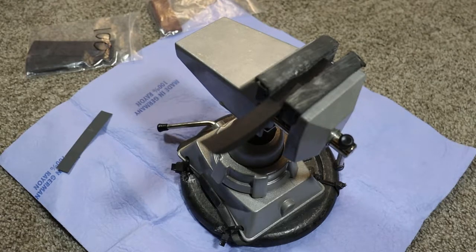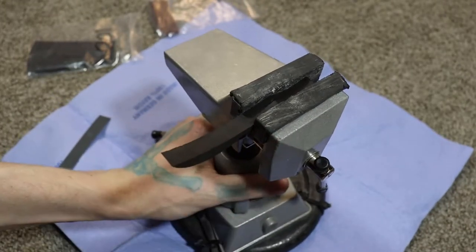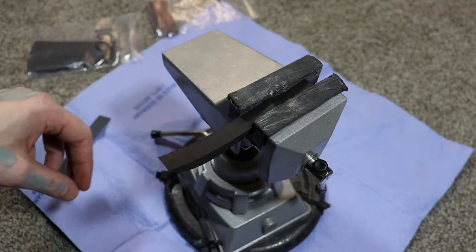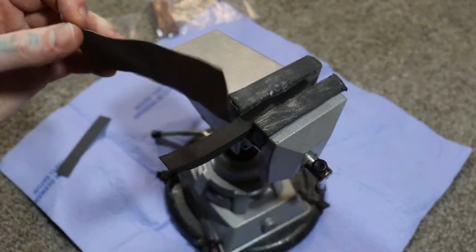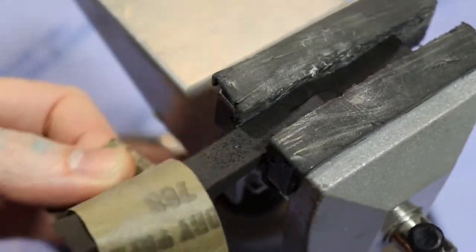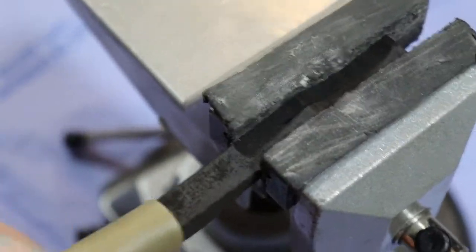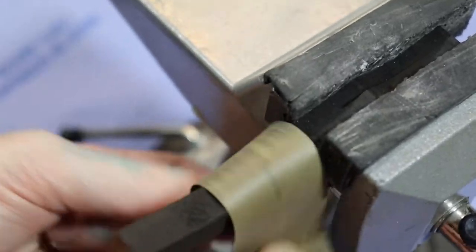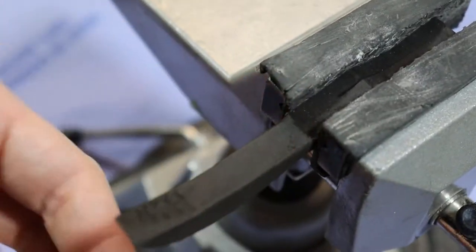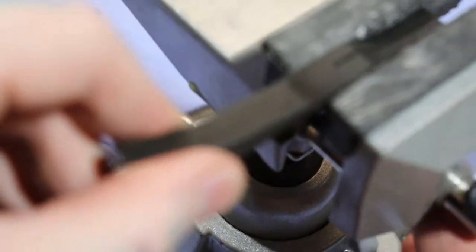This part really depends on what kind of finished look you're going for. If you don't want really blocky sides with straight edge corners — if you want it more round, nice and smooth — you take a piece of sandpaper cut into strips and just bend it over and do this. This will help you get it even. Make sure you try to apply the same pressure on both sides so you don't get it lopsided, and you can see how it's starting to smooth out and get rounded.